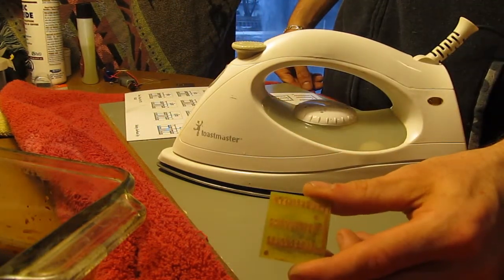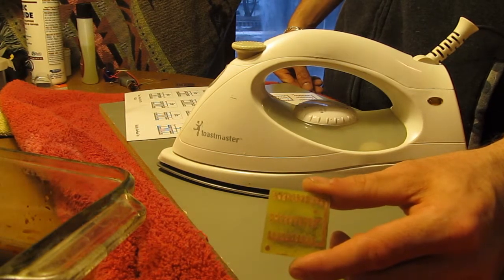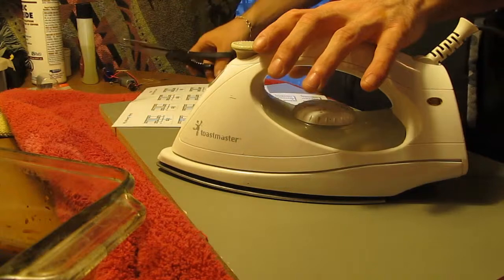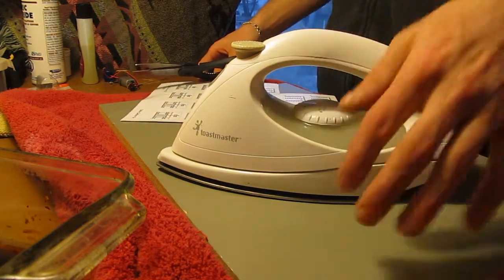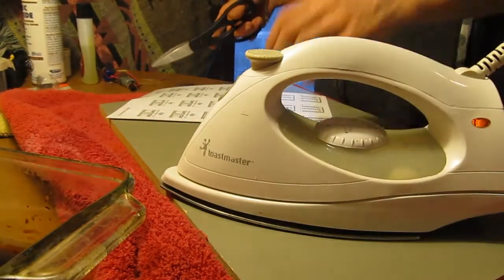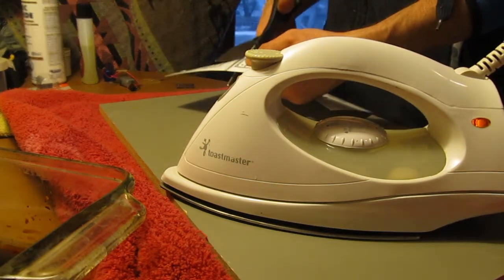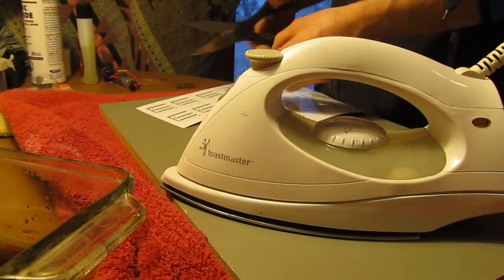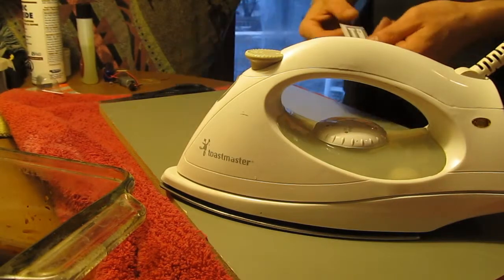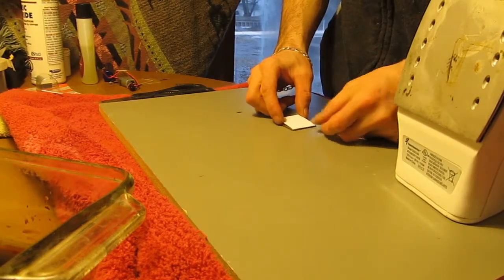After you get a PCB done successfully, you gotta drill the holes out. So you're gonna need a very small drill, I believe a number 80. So preheat your iron and use it to preheat the copper clad board. Cut out your PCB pattern. Place it on your PCB.